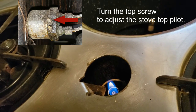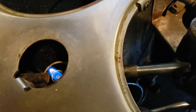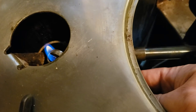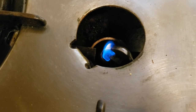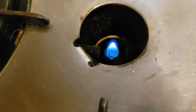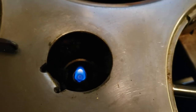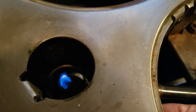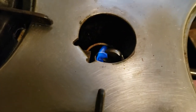I'm going to turn it back down. The tip is going to be just a little yellow. The easiest way to check the height is to remove the drip ring, stick your wrench in through here, and get right up to the burner. This is a half-inch wrench. You can see it's a little too high, so I'm going to adjust that back down just a little and it'll be set. Stick the wrench back through, and looking at that, I'm going to call that a half inch.